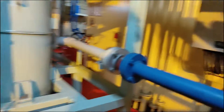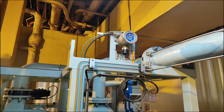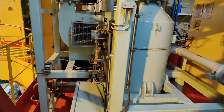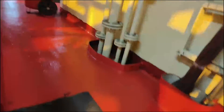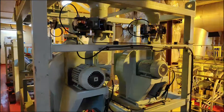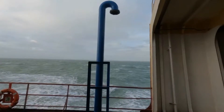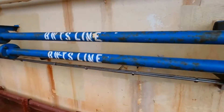Once the electrolysis process is done, the water goes to the next process where the cyclone unit is located — this is the cyclone module junction box. After the electrolysis process, a water cyclone is created, and these two blowers suck hydrogen from it and inject that hydrogen through this blue pipeline, so the hydrogen is released on deck.